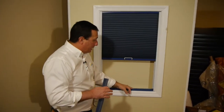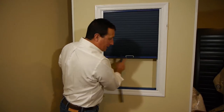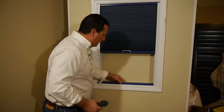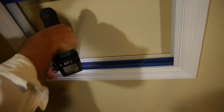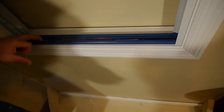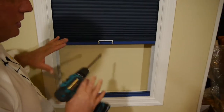The spring also equalizes the skylight. You want to be sure that once the skylight frame is standing straight, the cords on the very bottom are locked in place. Right now they're locked by a piece of tape, but that tape can get old over time. What I like to do is bring the screw up a bit and tuck the string under the screw head, then bring it back down. Now that string is tightly secured under the screw head, so it will never shift right or left — meaning your floating rail will always be straight.